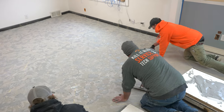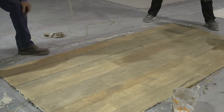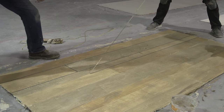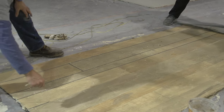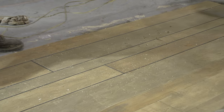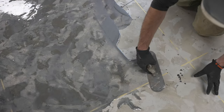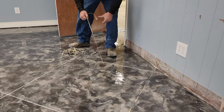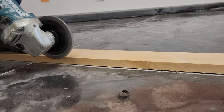If all you're putting on top of this tape is a cementitious overlay, pulling this stuff out is actually the fun part — no extra work required. There is a little bit of timing involved: if you pull it too soon it's going to chip a lot, but if you wait until the next day it normally comes up really nice and clean without chipping at all. For today's project it's a little different because we ended up putting metallic epoxy over this floor, and this tape is definitely not made to pull right up through epoxy. It came up pretty well, but we did have to do a little cleanup with a grinder, so if you're using epoxy, just keep in mind there will be one extra step.